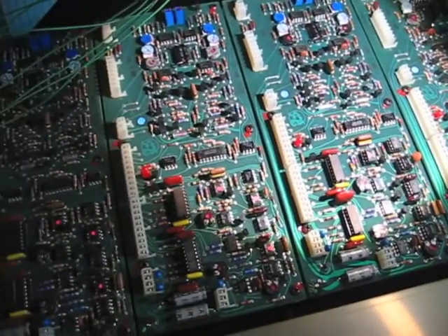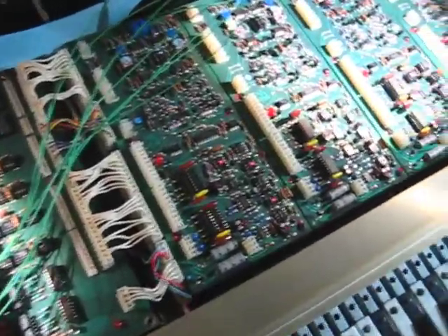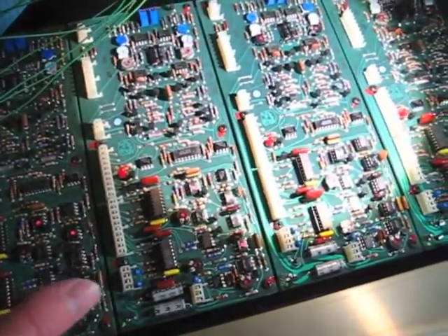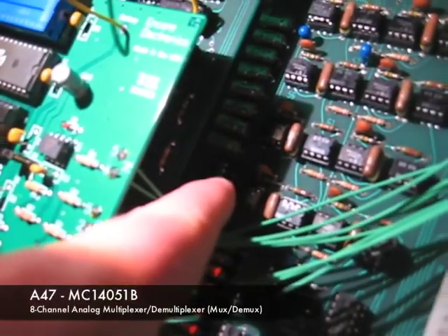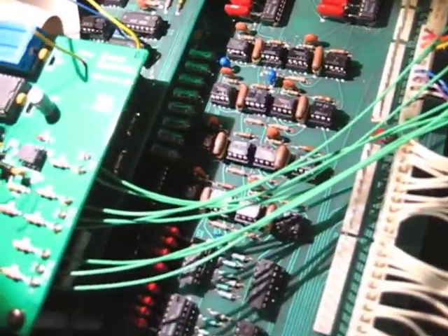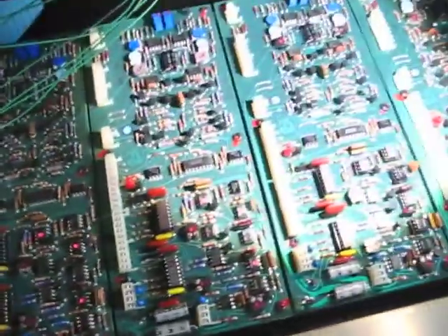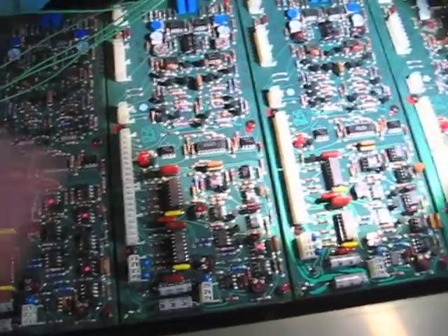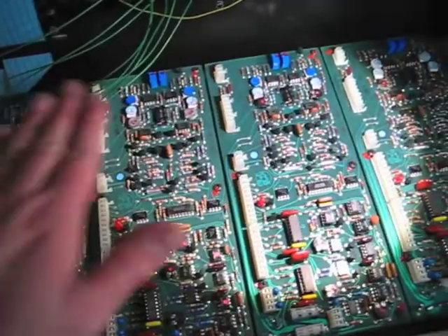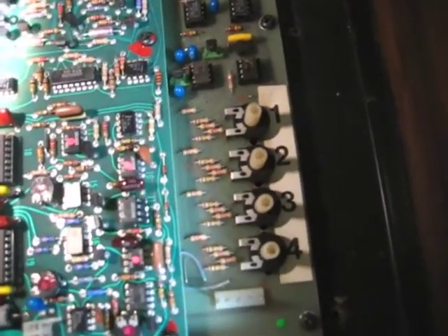What's affecting this board could be one of a couple of things. The thing I don't fully understand is how the autotune circuit works, but it may be an issue with autotune for this particular board. Everything comes back to this component down here. There are these eight capacitors here, and they're part of the signal path that connects to control voltages that go out to each of these voice boards. The reason there are eight is because this machine is capable of having eight voices — this one only has four. When you have eight, there's an extra set of posts here like a hinge, and another carrier board that sits on top holding the other four voices. As you can see, there are only adjustment parts for the four.